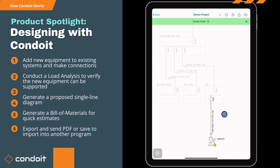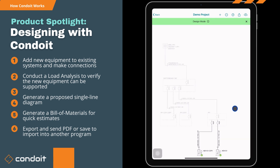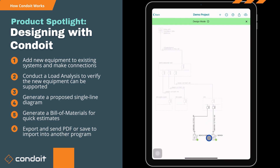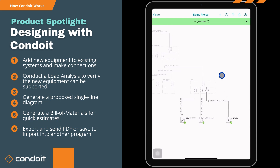Now we've got this Level 2 new EV charger inside our existing infrastructure — a new 40-amp three-pole breaker with a raceway out to the new EV charger. If we wanted to, we could duplicate this: it draws a new one with a new 40-amp breaker inside panel PP1. We can duplicate again and it just keeps drawing new EVs, so now we've got all our new EVs.